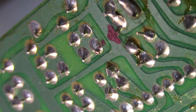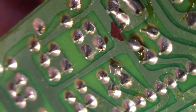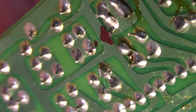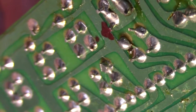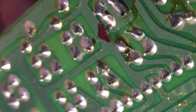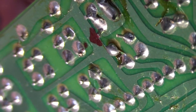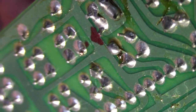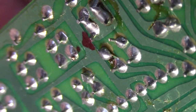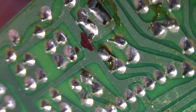As I bring you back in here, I went ahead and put the camera overhead so we can try to get a better look at this. Now that I've messed around with it, it's even looser than it was, but it wasn't that loose to begin with. To the left of that red arrow right there — you can see the lead moving in the hole. The actual solder is still kind of formed around the lead a little bit, so unless you're really, really careful looking, you'll glance right by it. May have been something I'd have found a lot quicker 20 years ago when my eyes were a little better, but I was scanning the board under magnification and it's definitely there.